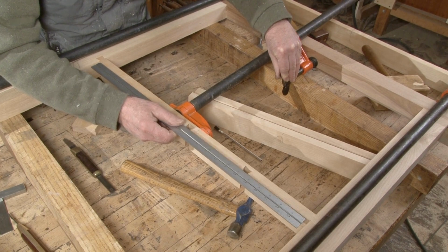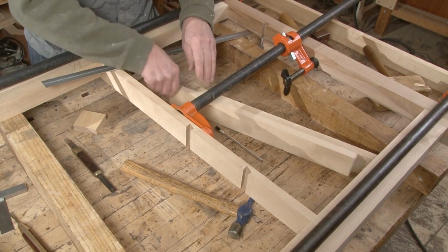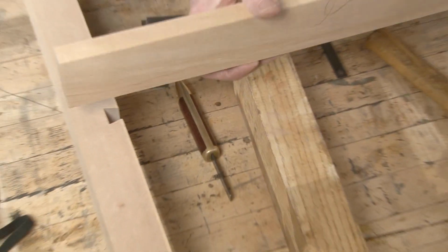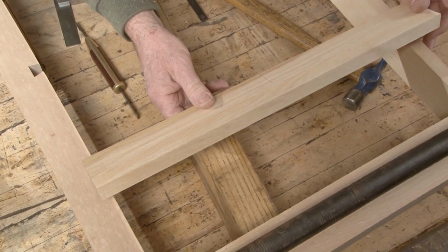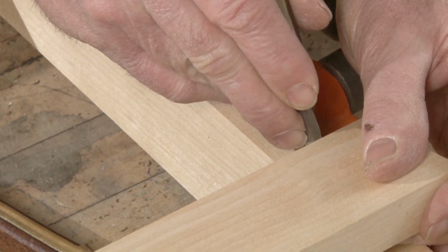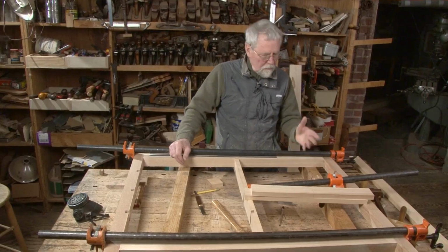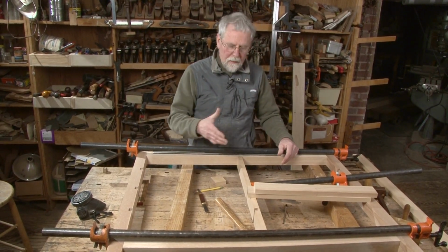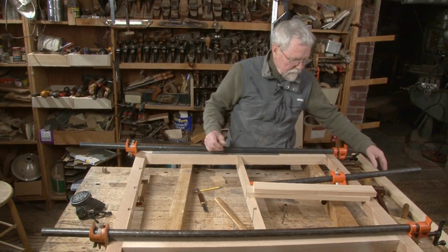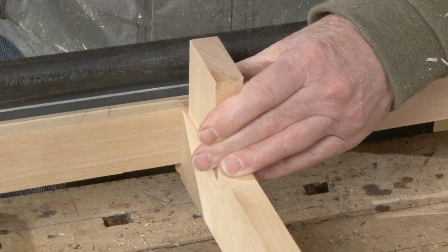That looks pretty good. So now I should be able to take a direct measurement for my lower drawer dividers up against here, and then I'll take a left-handed knife and give myself a length. Well, since we're here, we might as well lay out the lap joint for the long drawer divider, by tapping this partition a little bit deeper.